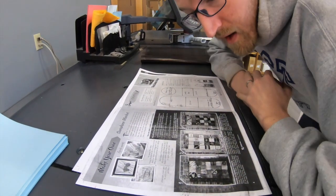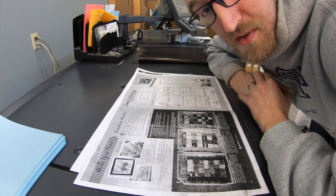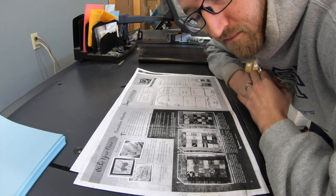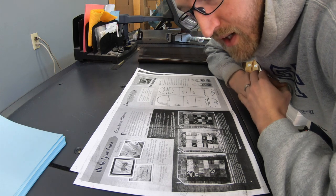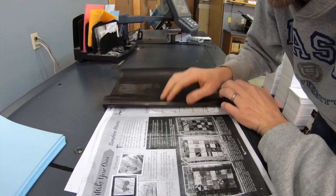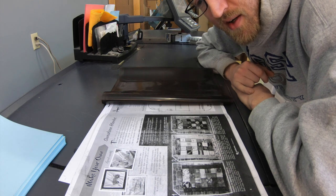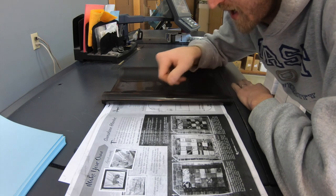So, I automatically thought it was a transfer issue, which proved to be correct. I let the technician know that it's like the toner isn't transferring to the paper correctly, and he agreed. So he replaced the transfer belt, and I think I looked up, this thing had like 3 million clicks on it, or close to it. And that's about what you get out of the belt, so it was time.